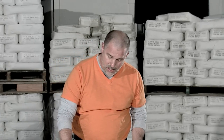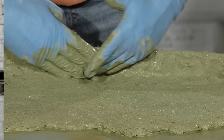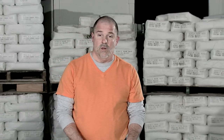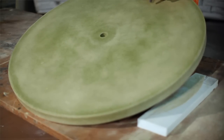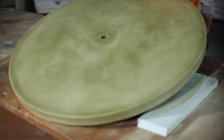After that, we're going to go ahead and build a two inch high rim all the way around the exterior or the perimeter here, and we're going to make it about three quarters of an inch thick. We'll also do the same around this knockout. And when we're done, what you'll see is the nominal thickness of this tabletop is going to be three quarters of an inch thick, and at the edge it's going to be three quarters of an inch rim all the way around the perimeter.